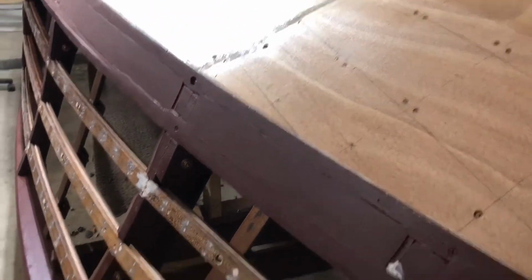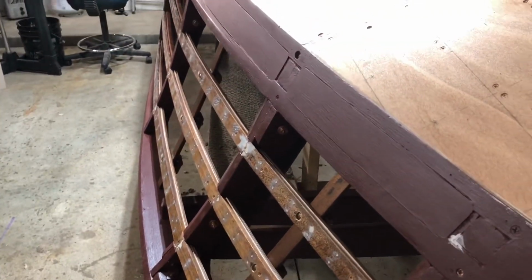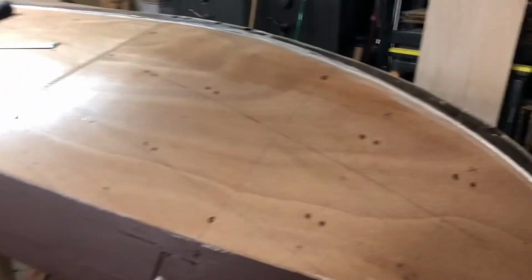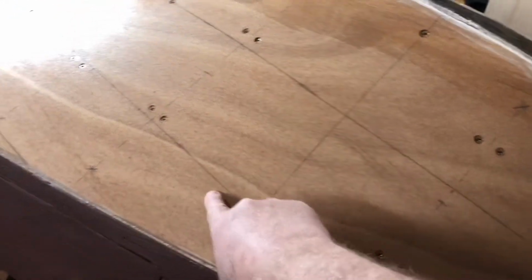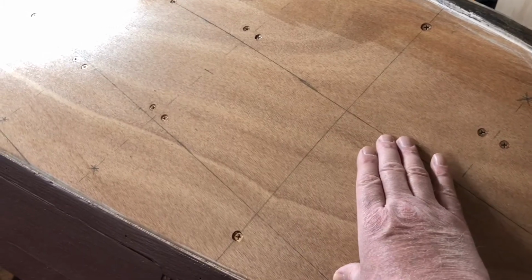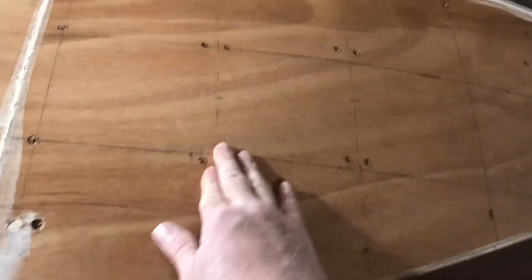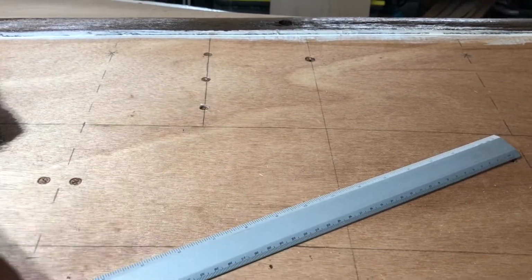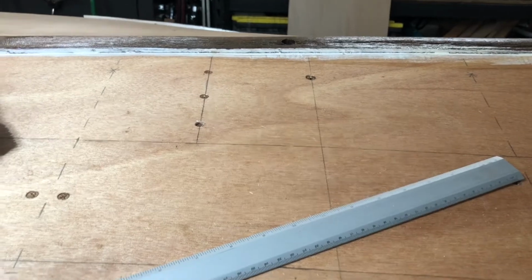So when I'm done putting the extra wood supports on the starboard side, the next thing I'm going to do is dry fit all the planks on the sides, the transom, and the bottom. So I already had the bottom planks laid out on the plywood, and I traced their outlines, so I have a good idea where they will lie. And then I finished installing all the battens and the backer blocks where there's 3 bottom planks on each side that have these butt joints with backer blocks on the other side. So all that's done.